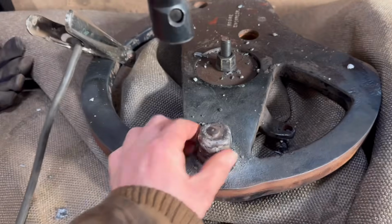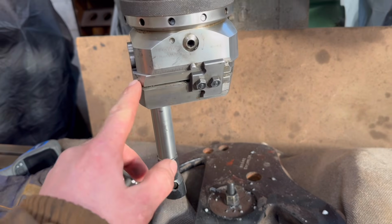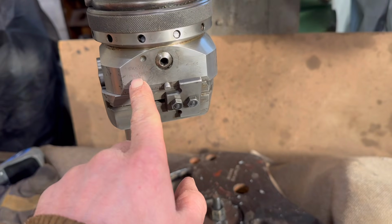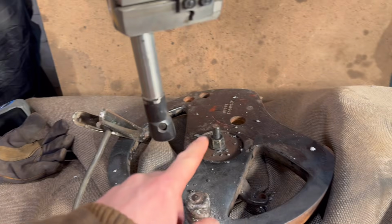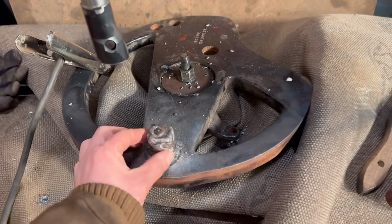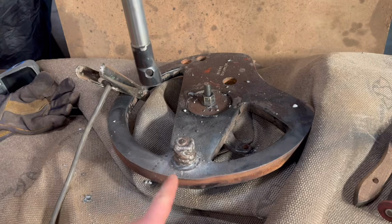Right, that's had time to fully cool down again now. So I know that that was set at 28mm when I cut it down, so if I wind that back out 2mm, even though, well, whatever that is in metric, so slightly bigger than 30mm, and then see, I might have to wind it, depends how much it's cutting off, and then yeah, cut it back down to 30mm.